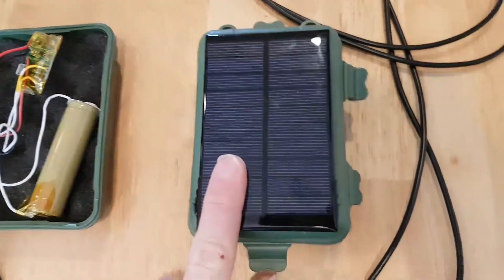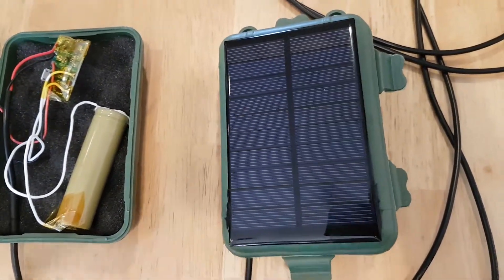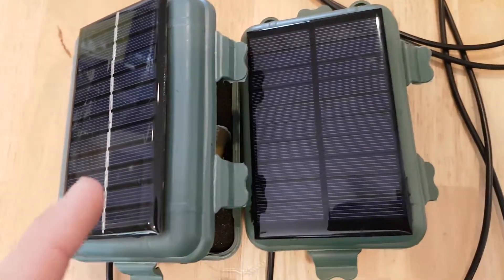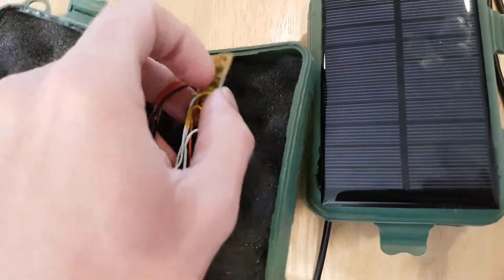This is my new battery box. It's 5 volt, but it's a 1 and a quarter watt panel. So going from 1 watt to 1 and a quarter watt, and it's still high enough voltage for the circuit board to charge the lithium battery.